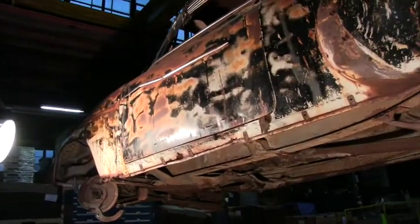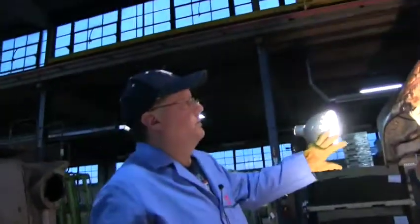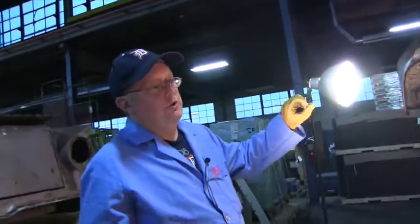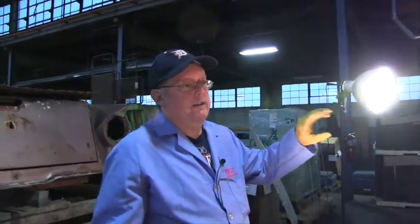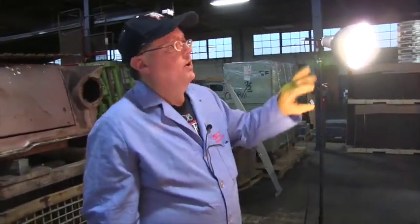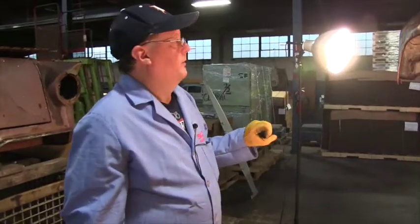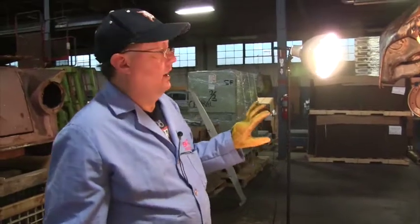Now, some of the engines and transmissions you're going to have to be careful of. There's a lot of people trying to use LS motors, and they're also calling the truck motors out of the GM cars, the 5.3s, the 6.0s, LSs. They're really more Vortec. Yes, the short block assembly is the same, but the external components are different for a pickup truck. They are more difficult to put into certain cars. I would not use an LS motor in anything prior to 1940. It's not going to fit well.